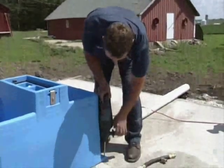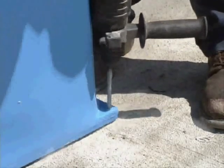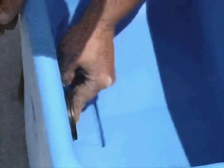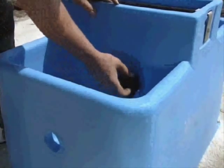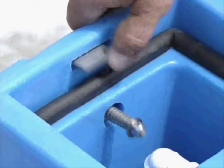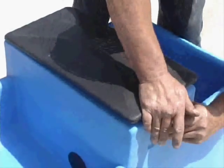A unique feature included with Miraco waterers is stainless steel anchor bolts. To mount bolts, drill a 3/8 inch hole into the concrete using a concrete bit and hammer drill, then drive anchor bolts into your drilled hole and tighten them. Make certain to insert the drain plugs from the inside and press firmly into place. A nice feature of Lil Spring waterers is being able to remove the drain plug and place it into the center hole during times when one or both sides of the waterer are not being used. The valve area is accessed without tools with Miraco's exclusive spring-loaded clips, giving you easy access to the waterer to adjust water levels as needed.